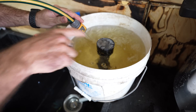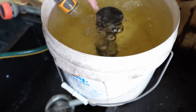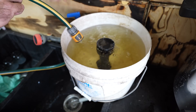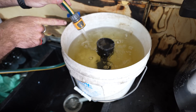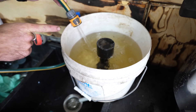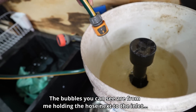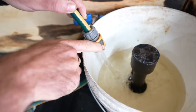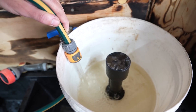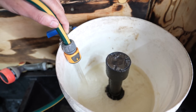So we can see the outlet here. Internally, we should start to see our siphon fill. There we go — and there's our siphon, coming out the base here, and that should drain our bucket entirely, even with our hose filling it up at the same time. The siphon itself should have a greater flow rate than the inlet hose. You can see the siphon working on the top through the clear window, and that will drain completely all the way down until our snorkel should break the siphon, and you'll see that happen once the water level goes below the snorkel on the side.